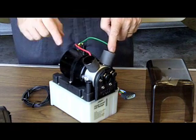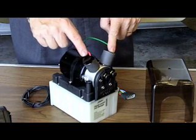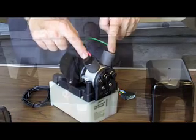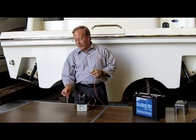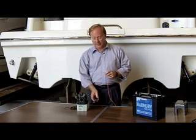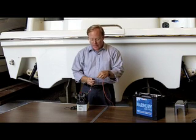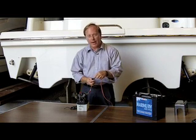It's also important to keep in mind that just because you hear the motor running doesn't mean that the valve itself is working. With the ground wire for our power unit connected to the ground on a battery, we can do a simple test with a hot lead from the positive side of the battery, energizing the four wires one at a time.